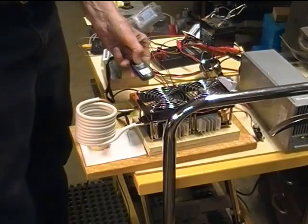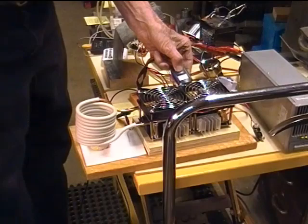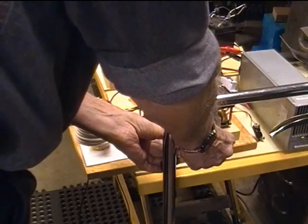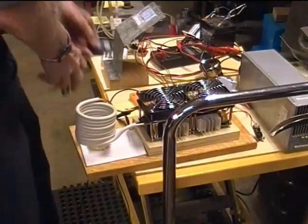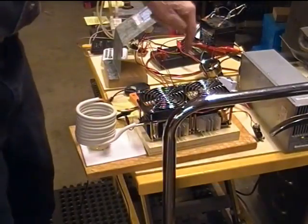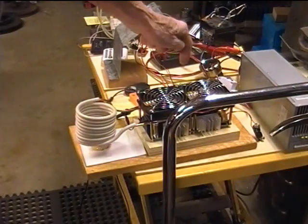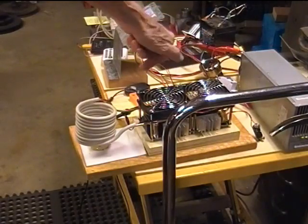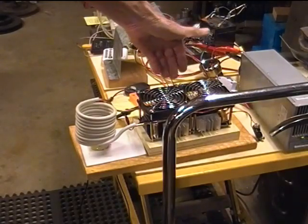Okay, quickly, MOSFETs, 76 degrees Fahrenheit, 80 degrees Fahrenheit, 70 degrees Fahrenheit, 70 degrees Fahrenheit. I think I found before that the one over in this far corner seemed to be running a little hotter. And I did say, and I'll say it again, that I think the specs are different. The actual on resistance varies a little bit from board to board. May also be due to slight differences in the drive circuit. Okay, moving on.